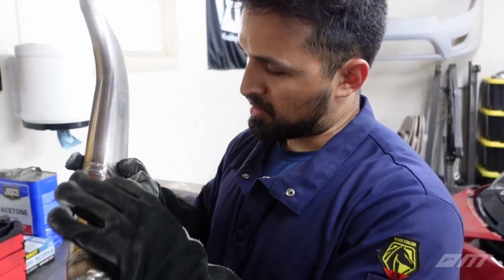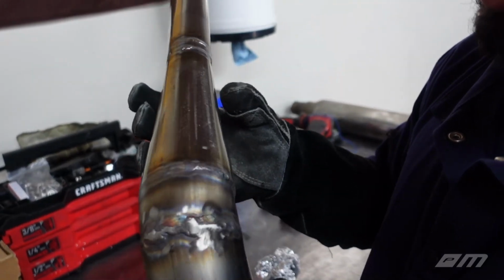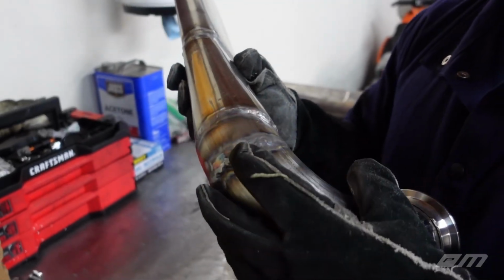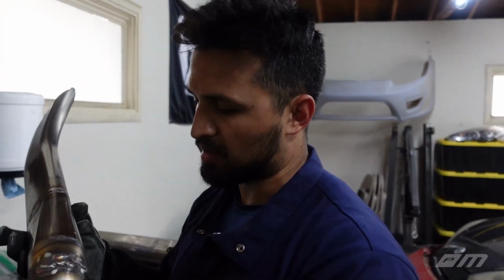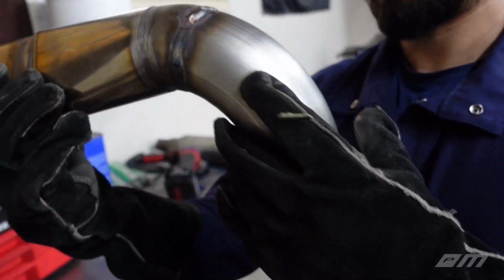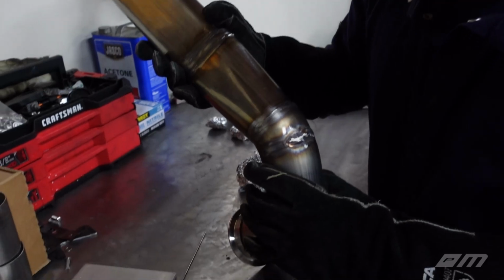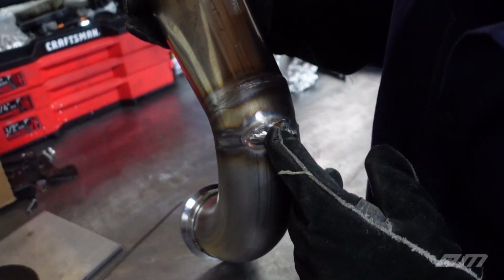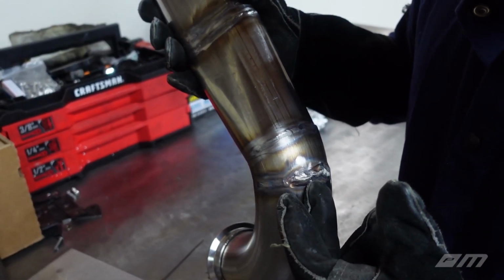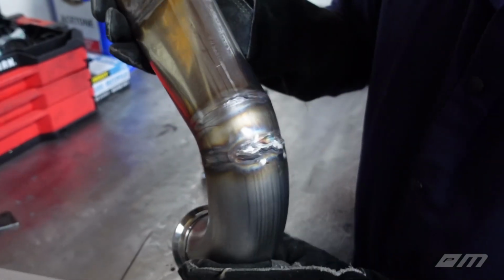So for the ones that were extremely flush, like the pieces were together, those were much easier to weld. Now this one had gaps here and there. Also, I imagine my pie cuts not being totally flush, but this is before we had the belt sander, which explains why this whole area was just jacked up. On top of that, that's where we have our 90-degree bend. So the pipe was stretched, therefore thinner around this area. So I was moving along and I was already way up here, and then it just burst open. I don't know if it was from the pressure from the gas or a combination of things, just it being thin, the gas, and me just jacking it up.